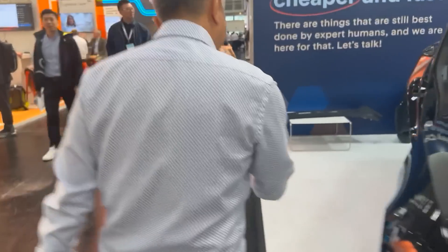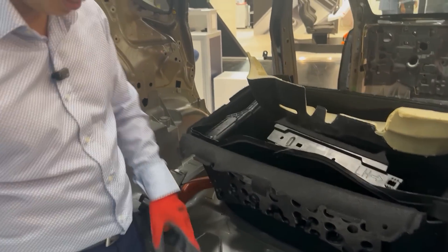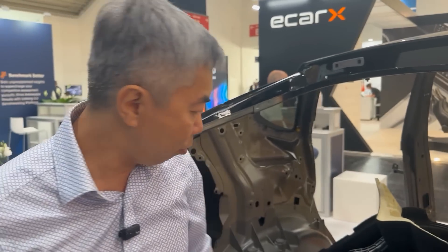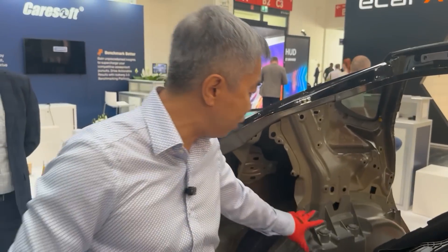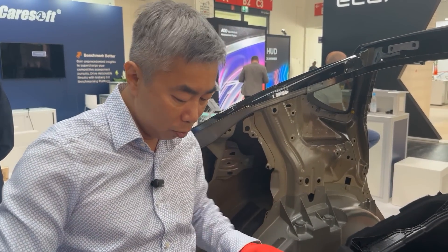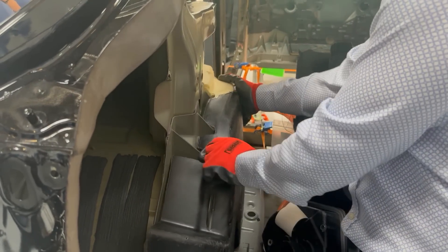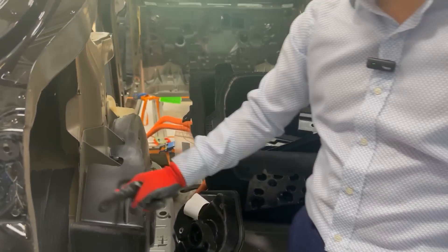Now the rear. You have a U-shaped giga casting in the back, so the operator can start from the inside and work outward. Giga casting is an expensive part, so they try to use it to the maximum. They put in references so you can install the insulation without any fastener — it just fits right into place. You use the form of part A to fit the shape of part B.